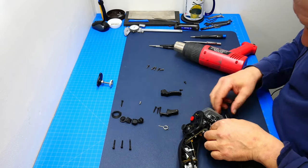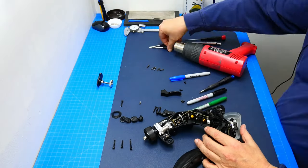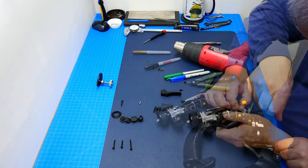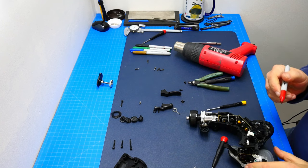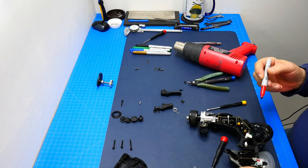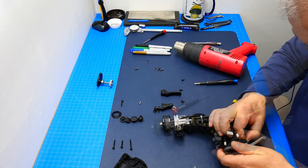The hot glue is definitely melting a little bit, so let's unplug that - it's also hot glued in here. We can take those out - there's one, there's two. Let's see if there's some on the bottom here and whether this whole assembly comes out. Let's take this one out first. Now we have a red one here. Let's get a couple of marks on here in different colors so we know which one goes where if they have the same pin layout. Carefully lift these out - you do not want to pull on the cables.